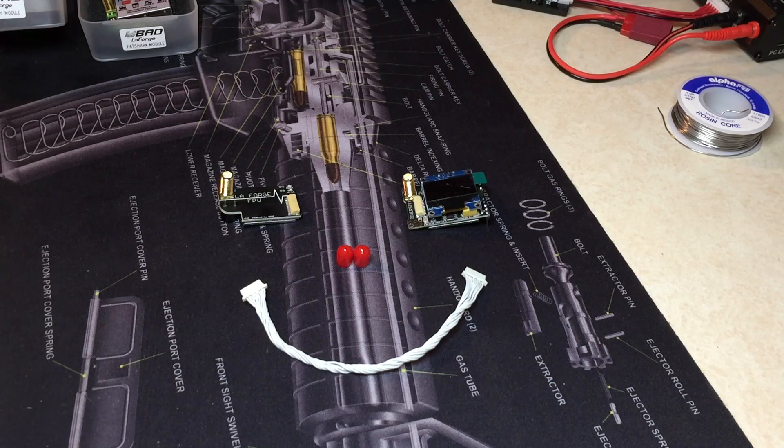To give you the features and improvements within the version 1.5 firmware: it now has a favorites mode that allows you to save up to 40 channels as favorites, with initial boot up to this menu. You can press select for one second to add or remove a favorite — makes it very convenient. They also moved the diversity menu, which is now under the setup menu.